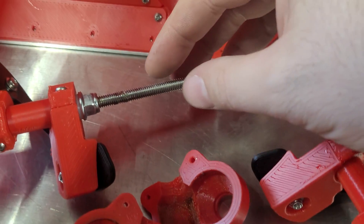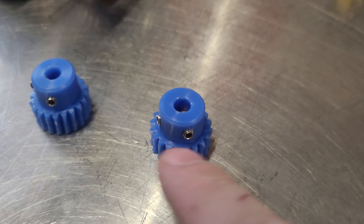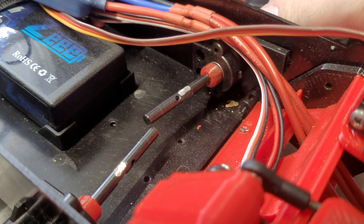Make sure it's nice and clean. And then also on your shaft, you're going to want to add another flat spot because there's two set screws. So I would do two flat spots just like I did here. That way it just has more holding power.